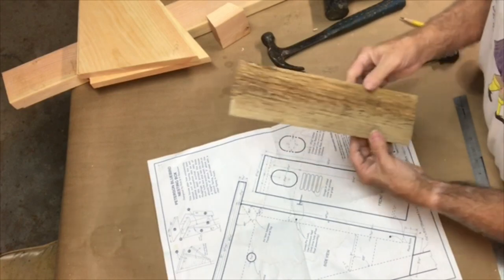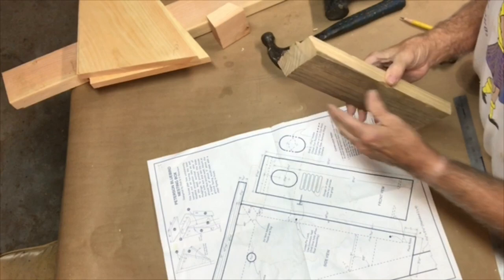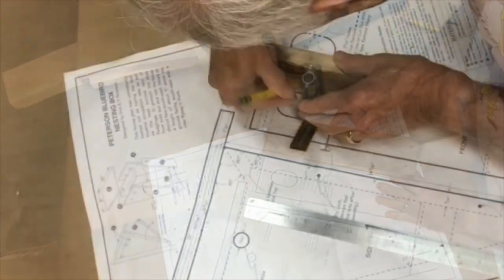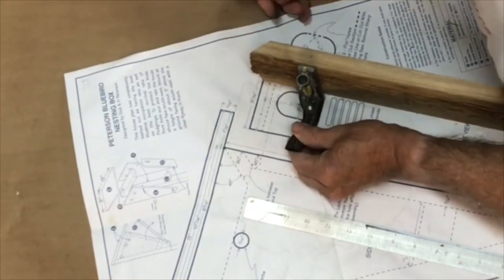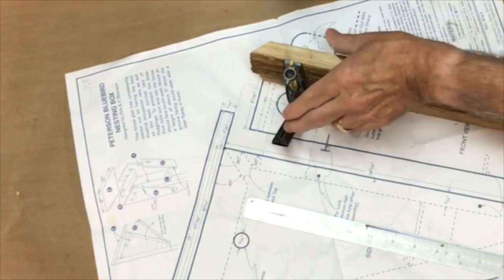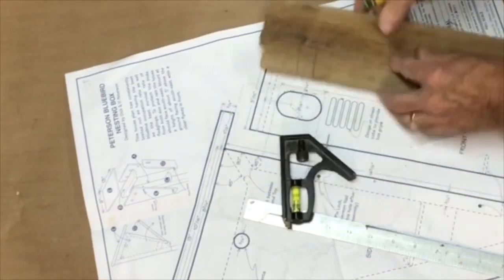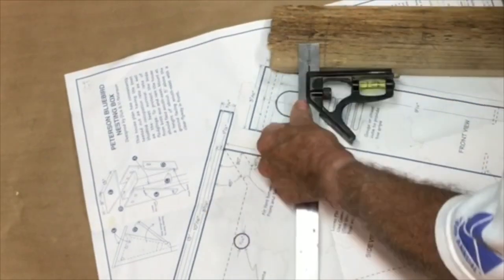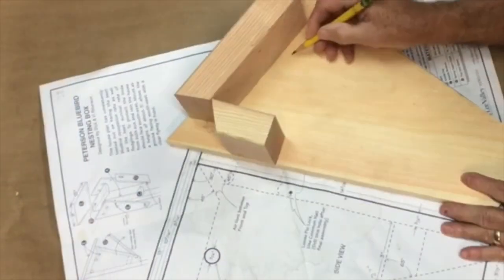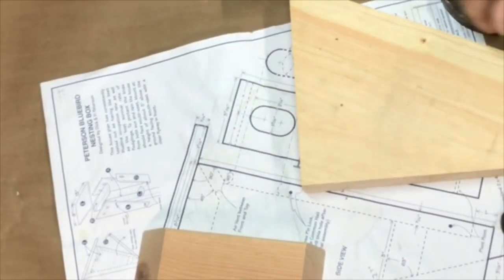Off camera I'm going to get fancy with the front — I'm going to use this old piece of barn wood I have. Cut a 45 degree angle here, and then this is 12 and a half overall. I've just laid this on the side and used this part of my combination square to draw a couple of lines to center, and then using that same combination square I can mark the holes — put one here and one about there. And over to the drill press.